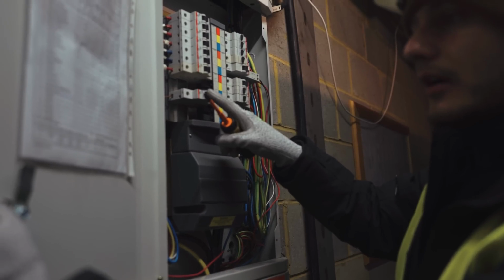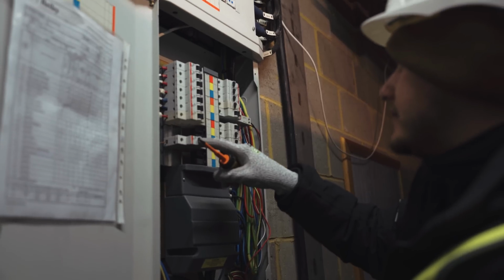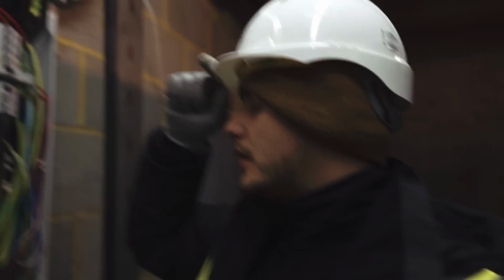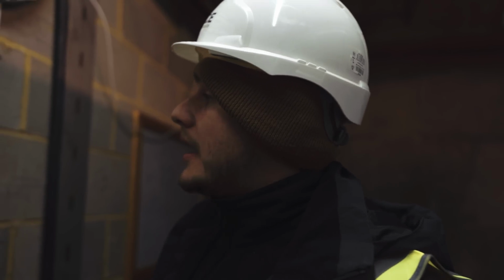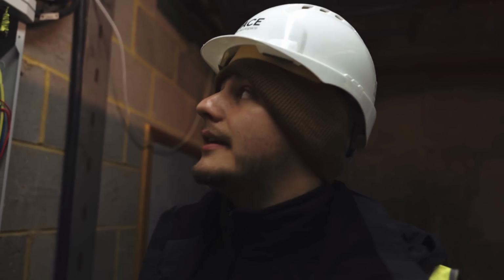We've got 7R, which is ECS controls and time switch. So that is the breaker that feeds these. I've got everything out of the breakers. I've got 1L1 connected to earth. Everything else is disconnected. That's basically going to be my form of isolation, removing of fuses. And then we've got a locked room. I'm going to put the cover back on, and of course we'll be proving for dead at the other end.